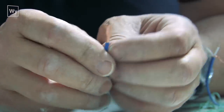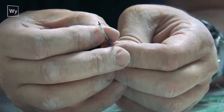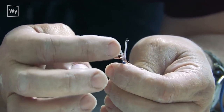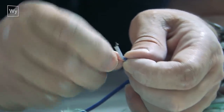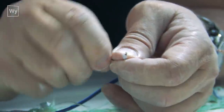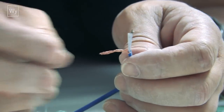I've separated the two center core wires — they carry the voltage — from the ground. I'm going to twist the ground together but make sure it's not intertwined with the voltage-carrying wires, because if they get intertwined you may still have a short when you're done with your repair. The idea is to get these wires isolated as well as possible before you do anything else.